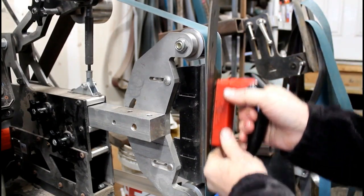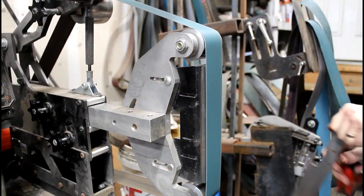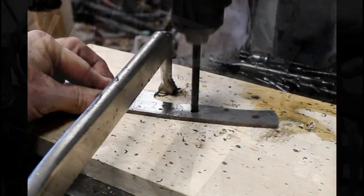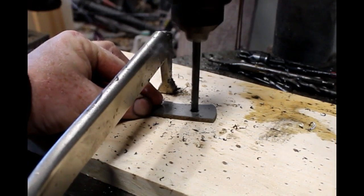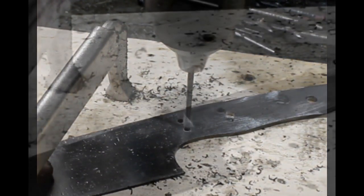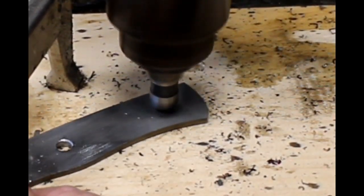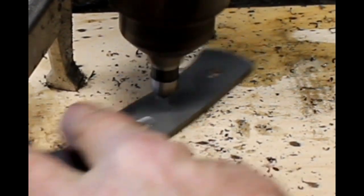This is really the majority of the work in doing one of these chef's knives — the rest of it is not really hard at all. So that's one side done; I just repeat that process on the other side. Even though the knife blanks come with pre-drilled holes, all of those holes do have to be reamed. They were only located and created with a water jet, so you want to ream those out to the correct size. I use one size up on the quarter inch holes, and I also ream down the one-eighth holes if I want to use bolsters. Then I chamfer each one of those holes — it makes it easier when you're placing the pins later. Make sure you ream and chamfer those holes before heat treating; it's almost impossible after.